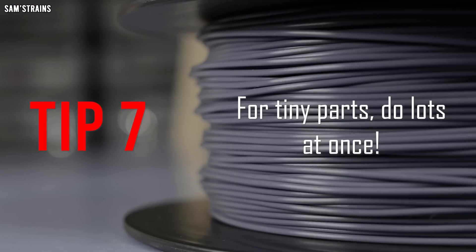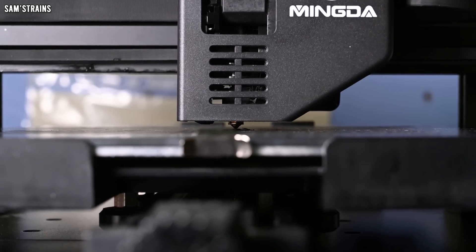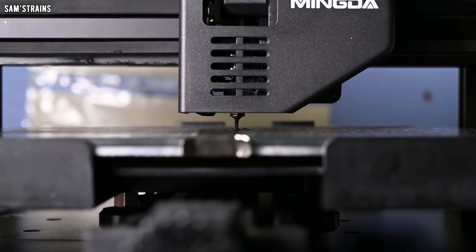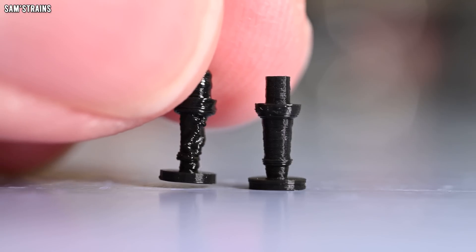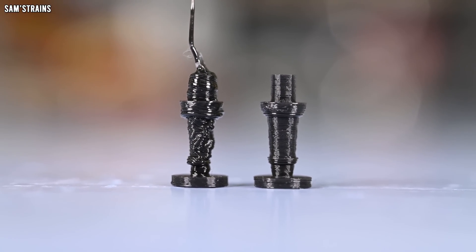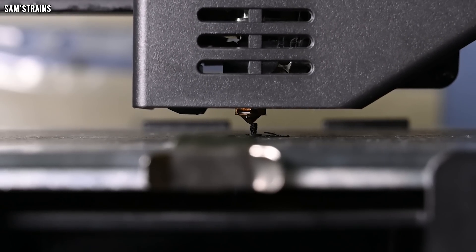If you're making really tiny parts, never just make one at a time — produce them in batches, even if you don't need more than one. This is a buffer that was created as part of a batch of 40 and as you can see it is absolutely perfect. Now I'm going to show you what would happen if I created just one buffer on its own. And here is the result — as you can see this buffer is a melty mess and I don't think it would fit into one of my chassis. If you create batches of objects rather than just single objects, your extruder will move between them on each layer, which allows them to cool rather than constantly working on the same one — and the part will never cool and never look right.